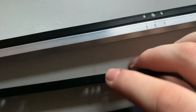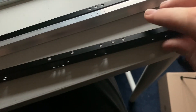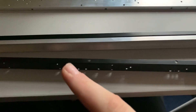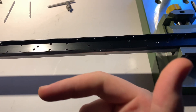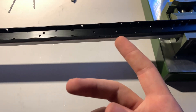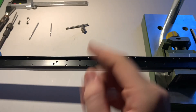What you have to be careful with is that on some of these rails the holes are off-center — they're more towards the edge rather than the inside. Also make sure you know which ones have got a thread inside, because that's a mistake you want to avoid, especially if you're going to reuse that rail.